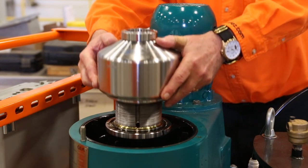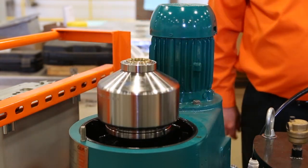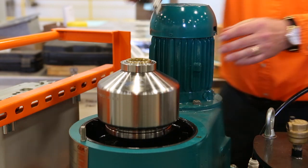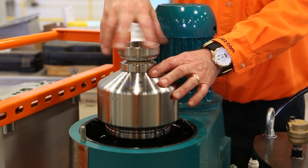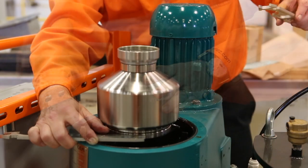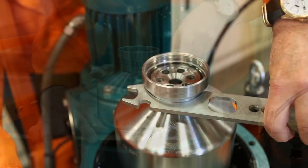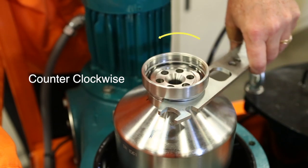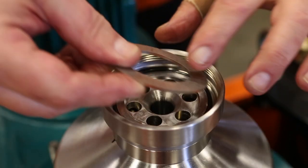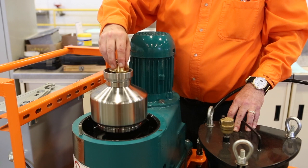Once clean, tighten the liner into a smaller OD and slip it inside the bowl top. Place the bowl top straight down over the bowl bottom and disc stack. If assembled correctly, the bowl top will seat with no gap at the bottom and the top of the separating disc will be sticking above the bowl top lip. Screw the locking ring in by hand. Using both multi-tools, place one tool over a stud into one of the slots on the bottom plate of the bowl, place the other tool on the locking ring and tighten by screwing the locking ring counter-clockwise. Place the regulating ring and the lock ring on the O-ring so it is centered inside the lock ring.